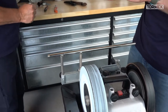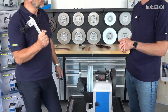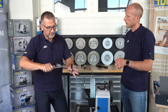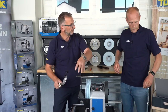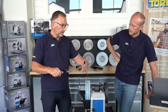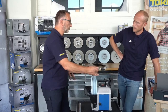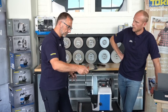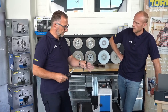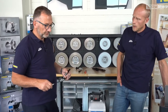If you were sharpening this knife on a regular SG stone, would you go edge trailing or edge leading? I've done it both ways. Edge leading is a little more tricky - it works, the stone is hard, not too much pressure and you need to develop the feeling. You can even do it dry without the machine moving just to feel how to follow the shape. On a Japanese stone because it's softer and there's less friction it's easier. I would never do rounded blades edge leading on a Japanese stone - the risk of catching is just too big. Edge trailing is absolutely secure.